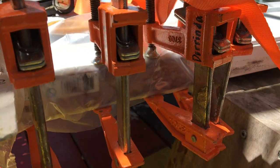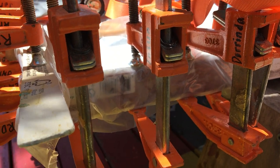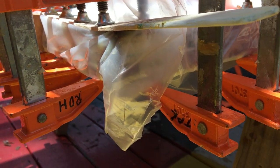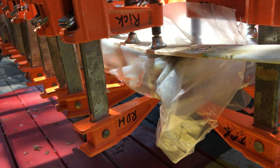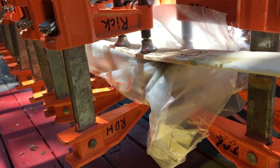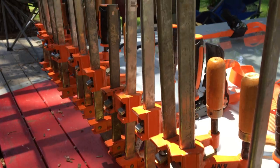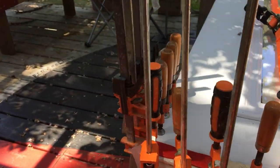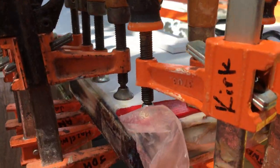What we had to do was cut a chunk out using our oscillating tool. We had a nice little piece of teak, cut a new piece for it, put some TotalBoat thickened epoxy in there — a lot of it — clamped it all together with all the clamps we have, and it's drying up now. When it's done we'll trim it, sand a little bit as needed, and get it back on there.